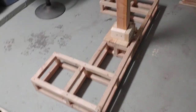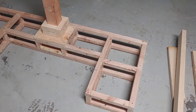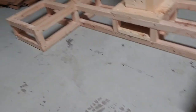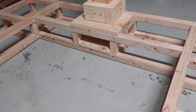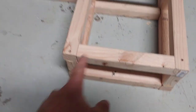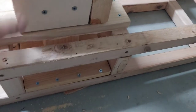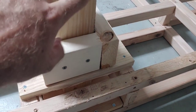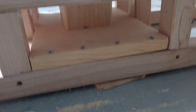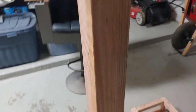I made two pieces of the frame and sandwiched them together. I wanted my deck height to be about half what the original looked like — the original is about 12 inches, so I made this six. These are one and a half inch pieces, that's three, plus a three-inch block in between, giving me a six-inch deck height. I made a plate with a hole just big enough for the four-by-four to fit in — it drops down and the plate supports it, with two-by-fours in place to level it all out.